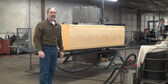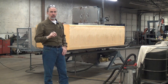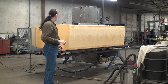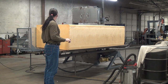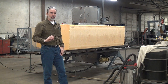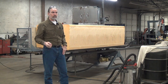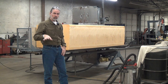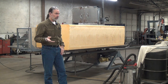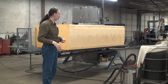The blade I am using is the wrong blade. It's a 1-inch wide, 10-tooth-per-inch blade. The material is about 1¾ to 2 pound per cubic foot density. The right blade for this would be a 1-inch wide, 3-tooth-per-inch blade. I've got a 10-tooth-per-inch on here — it'll cut a little more slowly and leave a finer edge quality, but really it's too fine a blade for cutting through this much material. But it's the blade I have, so I'm going to do it.